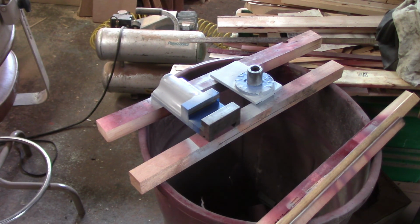Now what? I'm thinking of saturating the front on all three of those pieces, so that you can mush it into place. Just spray it, let it sit, spray it, and then hopefully that'll give me enough. Doing it on the backside doesn't matter because that's not going to stretch. It's really the front that I'm worried about. Okay. Wood compresses, it doesn't stretch. Cool, and then I've got this much of a blank, which should be enough for me to cut little pieces out and patch them.